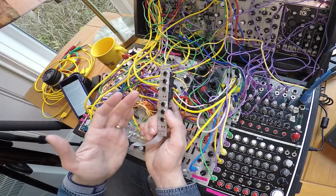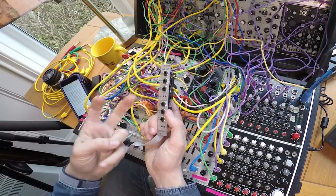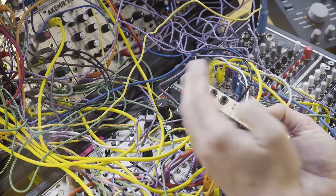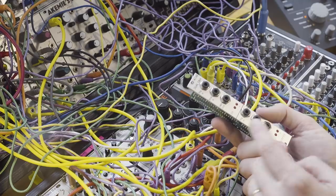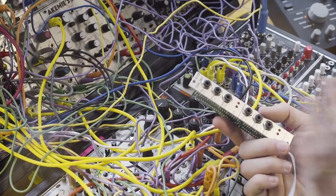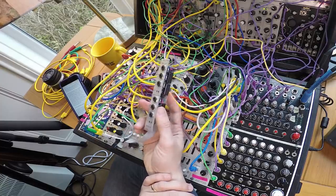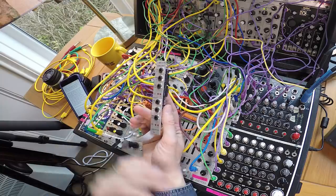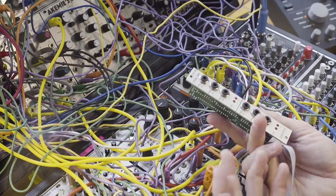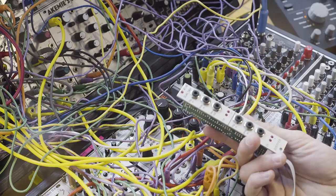So you might have it in your mind that sample and hold generator means random voltage generator. And that can be true, but that particular meaning, a random voltage generator, is born out of one specific way of using a sample and hold module, which I'll show you in a bit. But a truly modular sample and hold module, like this one, means that anything can be sampled and at any rate, and that can make it more useful. Sample and hold modules are not just modules that make the sound of how computers think.